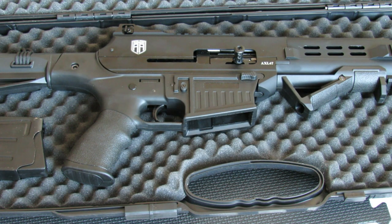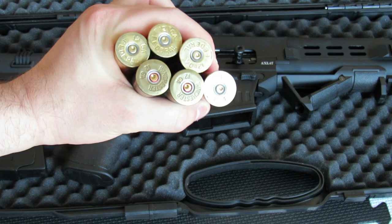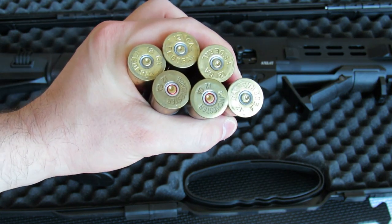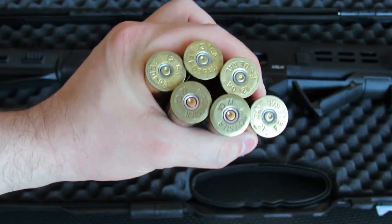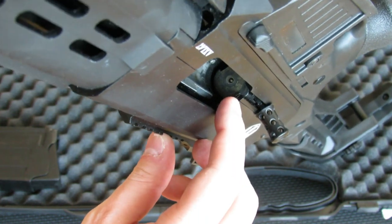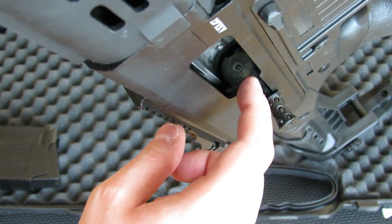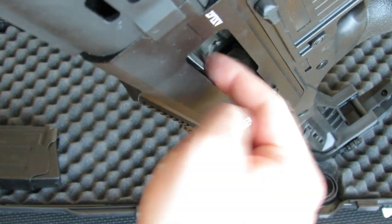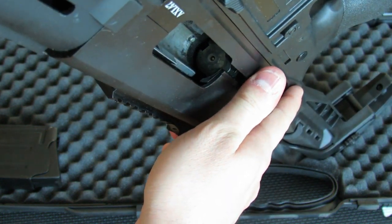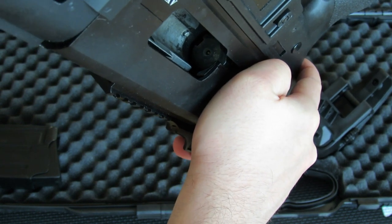The rifle is capable of shooting absolutely everything that I put through it. However, it does have a problem with light primer strikes, which is kind of strange to me because whenever I look at the shells that I fired, you can see that it really craterizes them. However, they are not actually centered, which on a centerfire rifle is supposed to be a problem. And if you look at the mark left by the brass on the bolt head, you can see that it's actually not even centered — the firing pin is off to the inside. I am honestly not sure if this is a defect in the gun or something more general to this particular model.